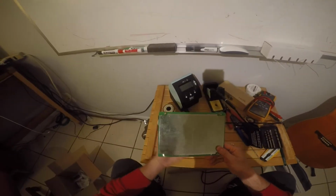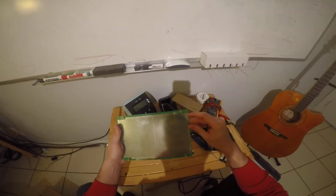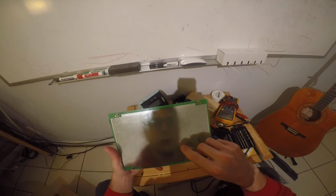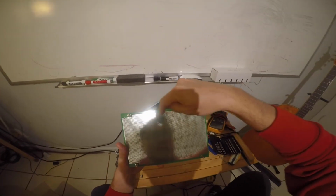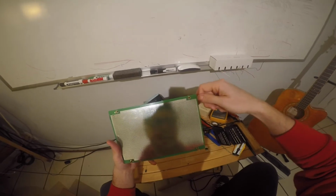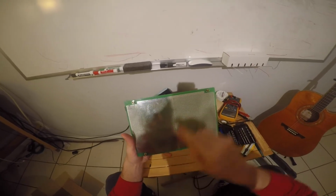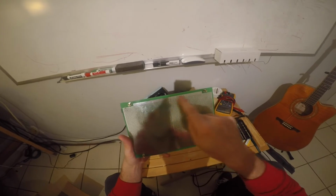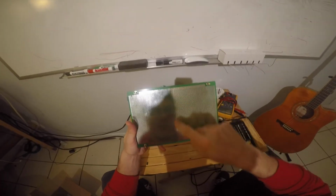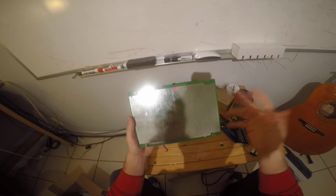Okay, cool. So let's take a look at the pattern of these pads. I don't know if you can see this on the video or not, but most of the pads are sort of like independent islands that aren't connected to anything else. But if you look around the periphery of the board, we have buses. We have a big long bus on the top side, on both sides, and on the bottom. And you also have an I-shaped bus that goes down the center, and it also fans out to both sides here. The ones that go around the edges, I'm going to use for power, and the I-shaped one that goes down the center, I'm going to use for ground. It doesn't really matter. You could switch that if you wanted to, but I'm going to do it that way.